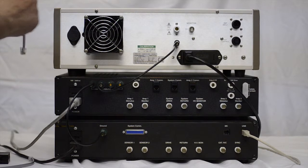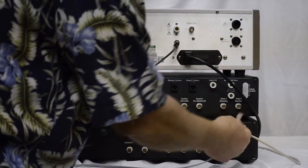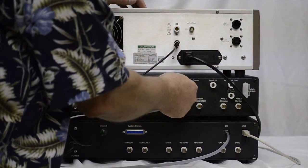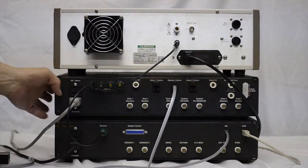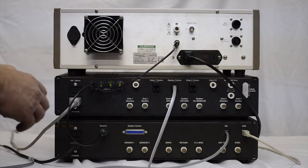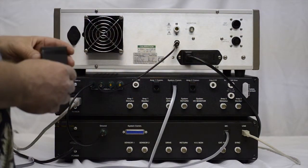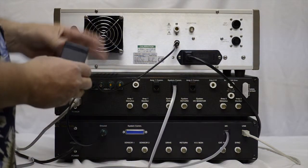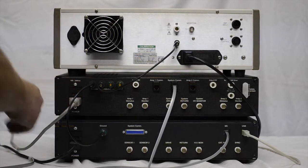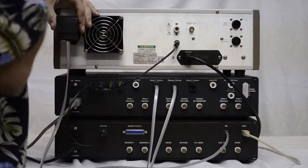In order for the software to operate, it needs to be aware of the physical characteristics of the attached accessories. We connect an I2C cable — similar to a telephone cable — from the I2C port on the rear panel of the tester to the system com port of the HVI. The HVI has an EEPROM whose characteristics are passed logically through the cable to the software. Similarly, every amplifier controlled by the software has an associated I2C ID module, representing all physical characteristics of the amplifier. This ID module is connected to the amp one com port on the rear panel of the HVI.